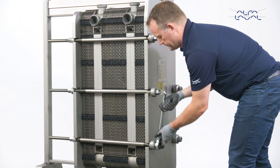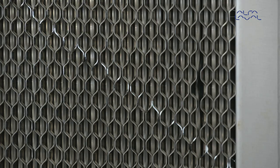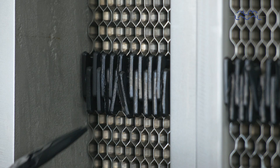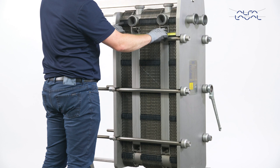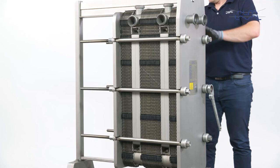While tightening the bolts, check that all gaskets are securely fitted in the gasket groove. If any gaskets are protruding, press them firmly back into the gasket groove using a pointy but blunt instrument. Be sure to also check that all gasket clips are positioned correctly and securely in place. While tightening the four tightening bolts, be sure to also tighten the locking bolts. Continue tightening until the A measurement has been reached. Do not over-tighten the heat exchanger.